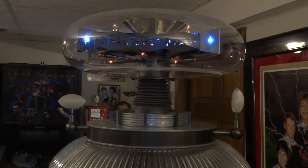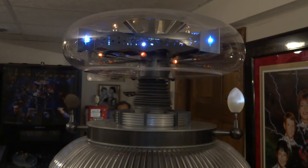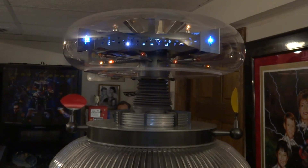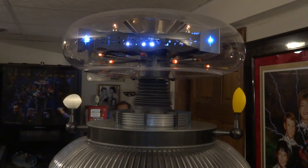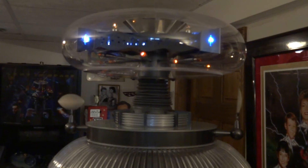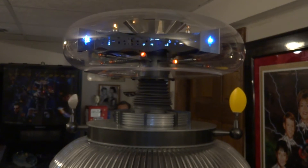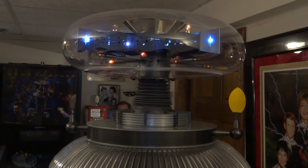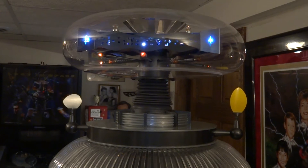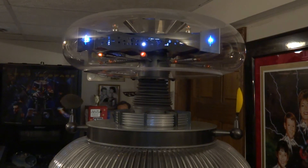That's 40%, 50% — so you've got to kind of find a sweet spot. We're at 69% right there, and between that and 100 there's really not a whole lot of speed difference, but you get a little bit more whine at 100. I'll go from 70% to 100%, 70%, 100%, 50%, 30%, 22%. They're really quiet but they're really slow. I found the best for me would be about 45% PWM, and that's an acceptable noise level for me.